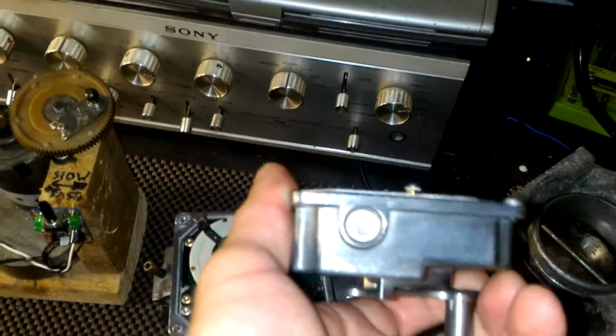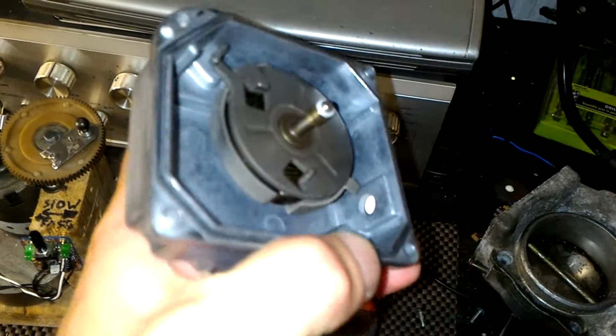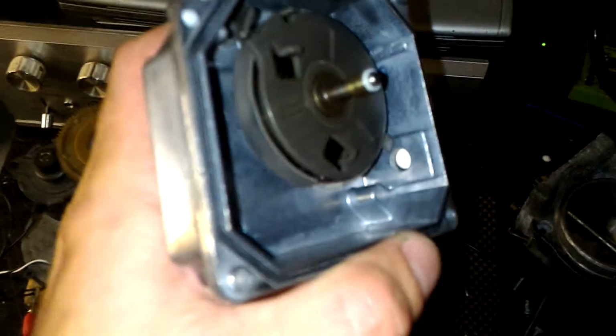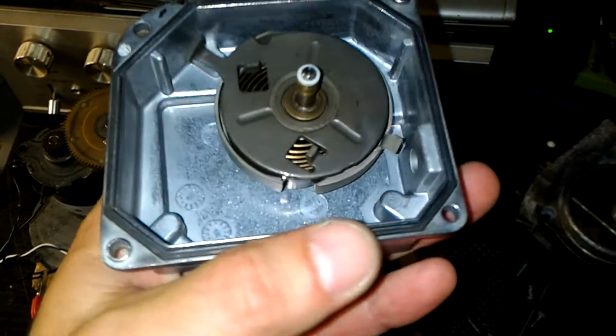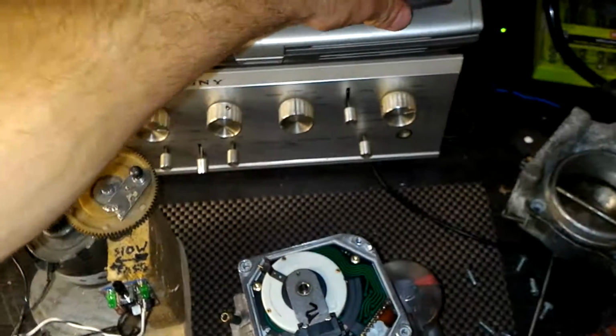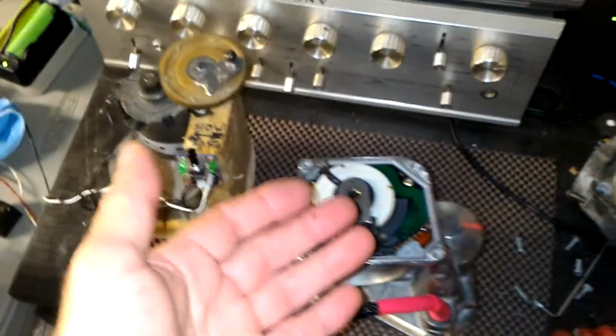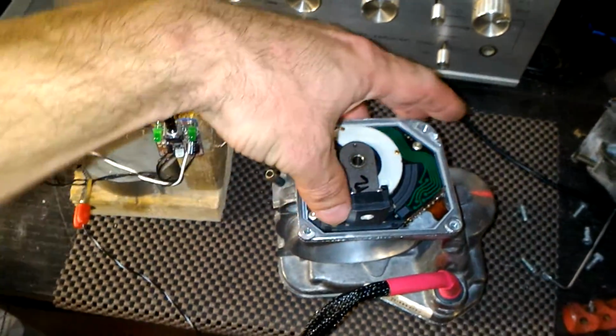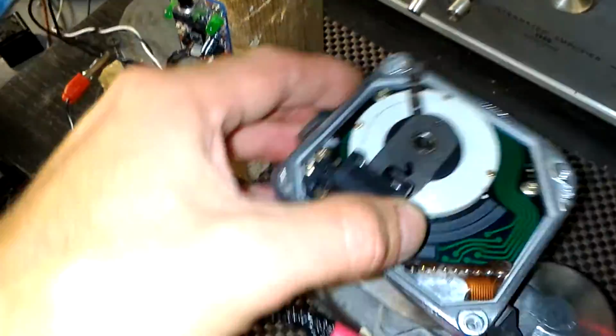because here is your vent. See this little white piece? This is the vent. That's where the moisture is supposed to escape. But if there is too much and the unit is not active for a long time, it accumulates, and once you put it on, it heats up, then water starts to vaporize.